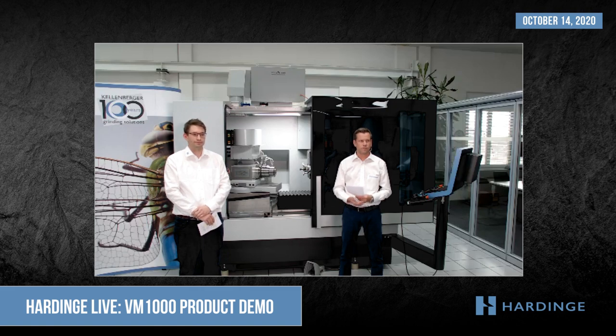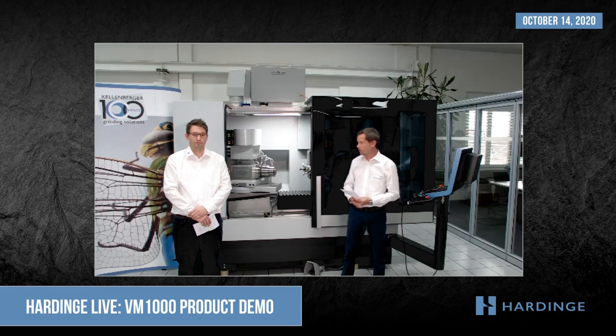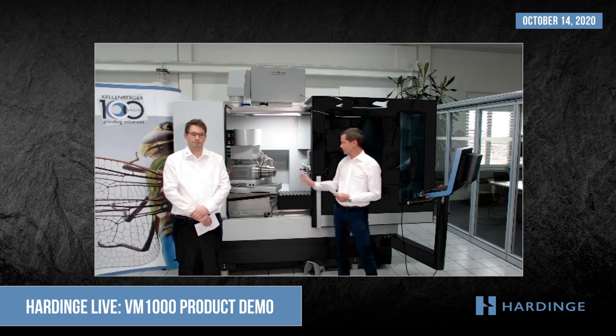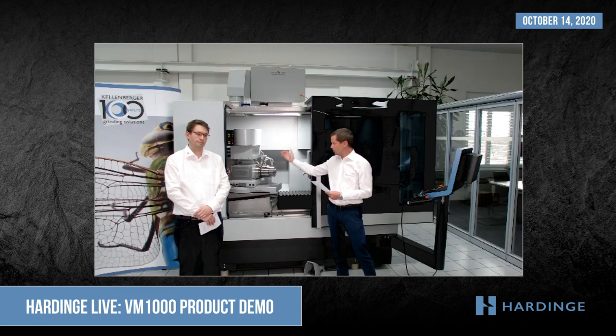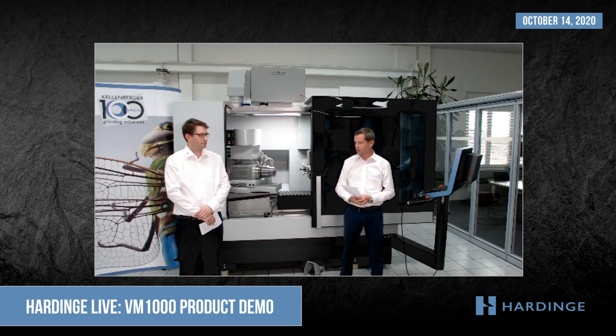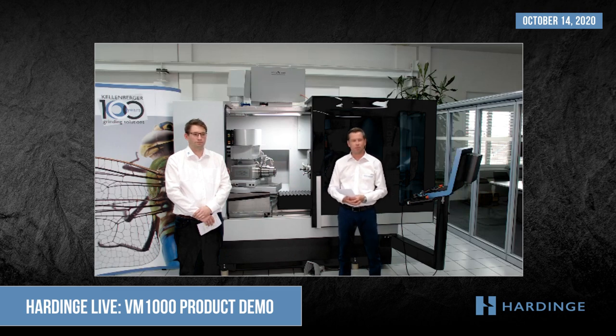Okay, Patrick, is loading capability available on this machine? Yes, on the machine a loading is possible. The loader on the left side of the machine, the workpiece carrier swivels to the change position or to the loading position. The loader loads the parts and the workpiece carrier swivels back again to the grinding position. We already have a concept with the V-step from the company Wenger.